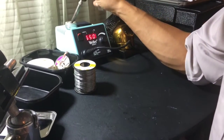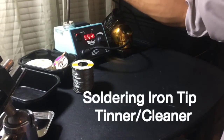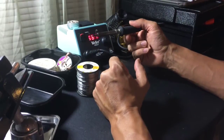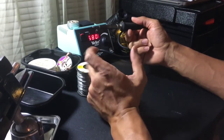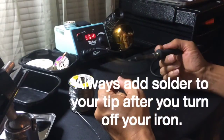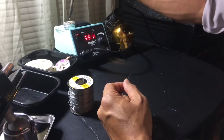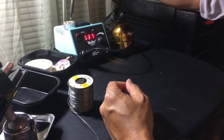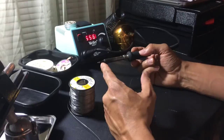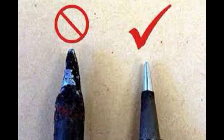On top here I have a compound used for tinning the solder tip. You need to apply it every once in a while when you start to lose heat conduction on the soldering tip. It's very important to always have the soldering tip nice and shiny. You can apply solder directly onto it and then clean it off, or you can use the solder paste — dip your soldering iron in there and because it's acidic it'll take away any residue. Then clean it in your brush or sponge and you'll have a nice shiny solder tip, which allows good heat conduction between the iron and your piece.